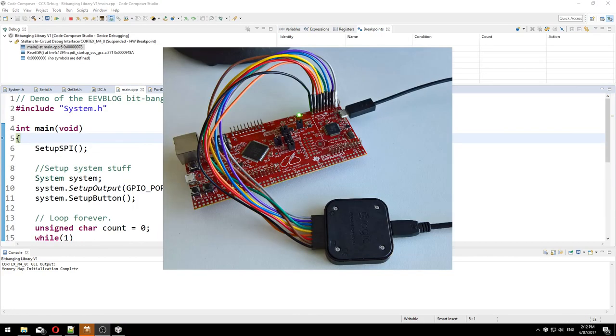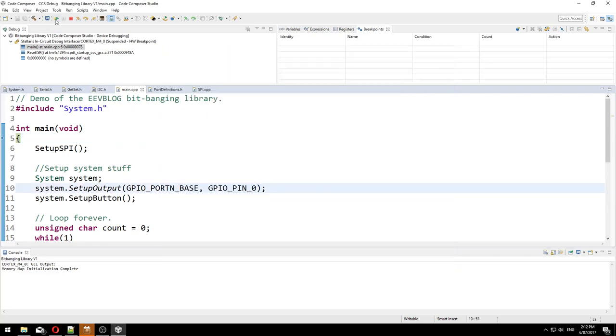Before I start the simulation, this is our setup. This is the Tiva C setup. It's a TM4 microcontroller, a Texas Instruments device from around 2014. And we've got a Saleae Logic analyzer bringing feedback into the computer. We can read back the SPI frame in the Saleae Logic software on the PC, so we can confirm that our protocol is correct. Okay, we're just going to run it now.